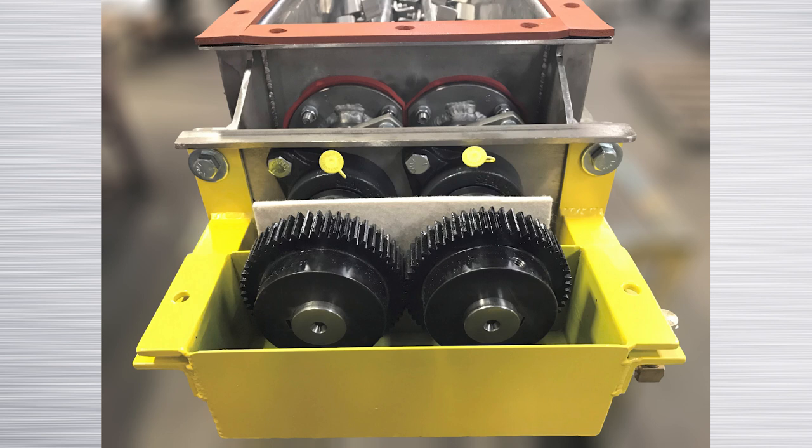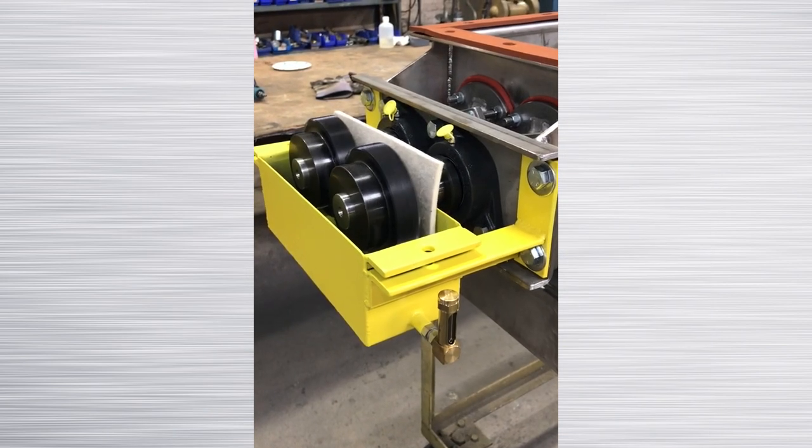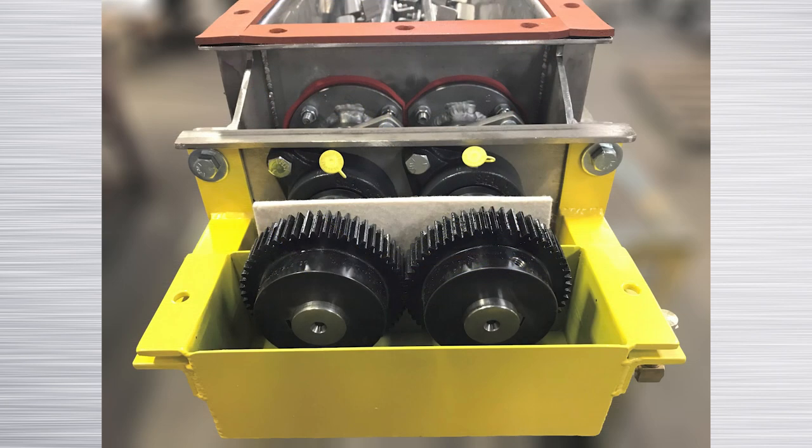On the end opposite the drive, heavy spur gears transmit the power and speed to the second shaft, assuring both agitators are evenly balanced for optimal mixing. The mixer uses a packing gland for the shaft seal and is available with lantern ring and air purge connection.